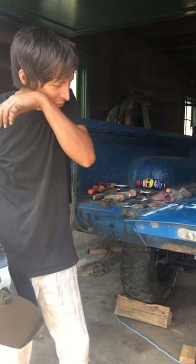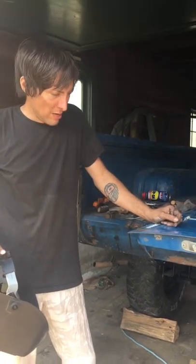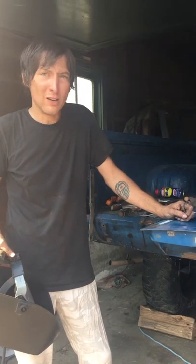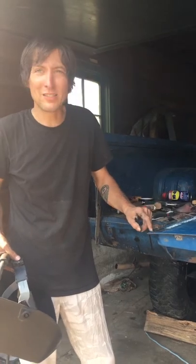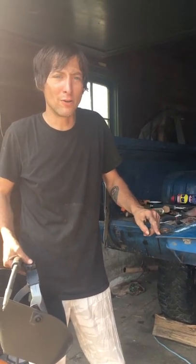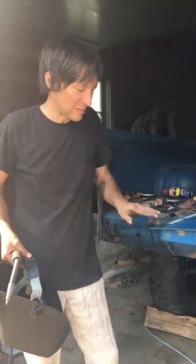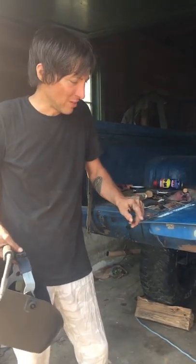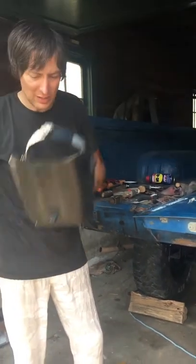What I'm trying to do is — with the welder I have, it only has preset voltage: A, B, C, and D. When I put it on A, I'm not really getting that much weld penetration. So I'm trying to do B as much as possible, just so I know it's welded on there really good. Sometimes if it hits a little thin spot it'll burn a hole, so I've been jumping back in voltage. Just doing the best I can. Basically I'm just going to tack this in, keep tacking it. It's on the corner, so I'm really not getting much warpage. Let's get it tacked.